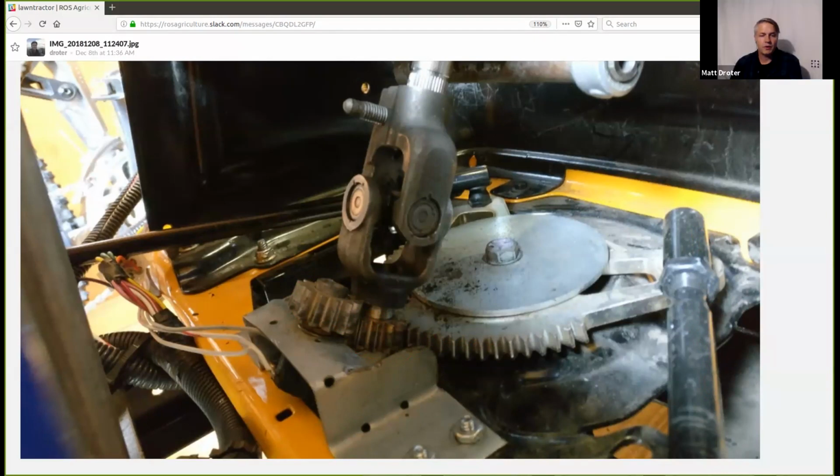I mean, maybe there's a way to change that bolt and the washer system around so that you put the potentiometer there. There's a lot of force on that with the wheels bouncing around. Or could you mount the potentiometer directly above that bolt and then have an arm that comes out and grabs onto the gear somewhere? So it's an arm sticking out, and both the gear and the pot would be rotating around the same concentric shaft or same concentric line. Does that make any sense what I'm saying?